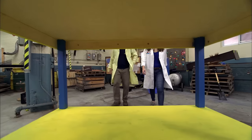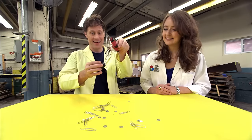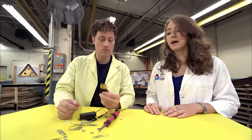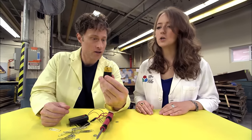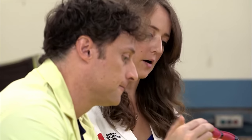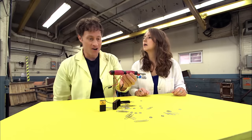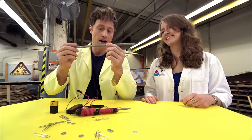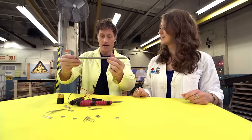So today, Heather, I want to max out the electromagnet — turn it on, and it's a magnet, turn it off, and it stops being a magnet. I want to make this into a much bigger maxed-out version. So what are some of the things we can do? Well, if you have a larger battery with a higher voltage, we can try that. There are batteries that are 12 volts. You can also increase the number of wraps of the coil — the more times we wrap that wire, the stronger the magnetic field. And of course, the nail is important because that's the thing that eventually becomes the magnet. So what I thought we'd do is start with a bigger nail. So: larger battery, more voltage, and a lot more wraps of wire. We have more space for that now. Great, let's get to work.